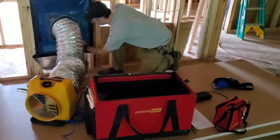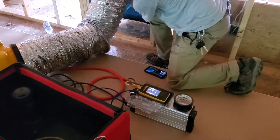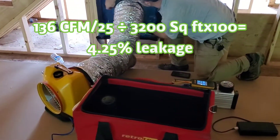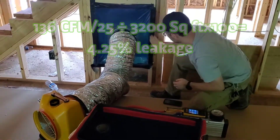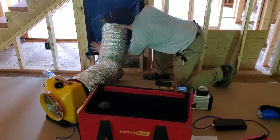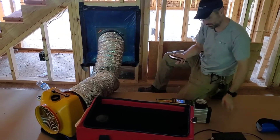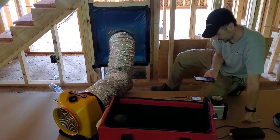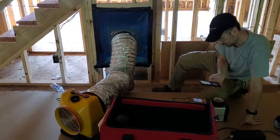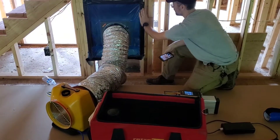We are running a little bit higher than what we really wanted to — about 136 to 137 CFM at 25 pascals, which equals a little over four percent duct leakage. It's well past code but it's not as low as what I personally want as the contractor. One of the things I found was that our dehumidifier down in the crawl space is leaking a lot of air, so we're going to have to spend some time sealing those leaks up and look around for other possible causes. This will get retested at finals, so hopefully our final number will be considerably better.